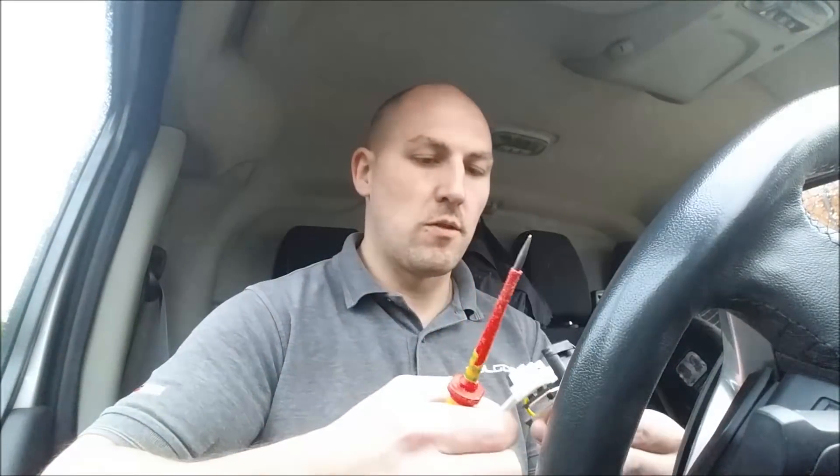That is actually one downside of this. The builder did a great job putting the lights up — he should have put the earth wires in. But in theory, if he was to put them in, I wouldn't be able to terminate them, because the terminations are attached to it and it's got a fire seal which is that thick. So it is a bit stupid really. I physically would not be able to terminate them — you'd have to do the terminating before the lights went up, then plaster them in, and then you could never get to the terminations again. They'd be lost forever.